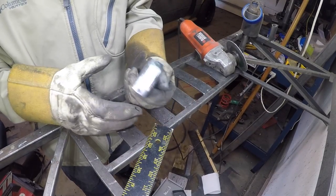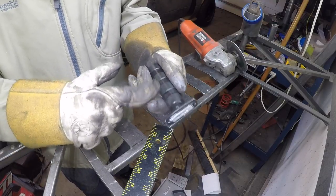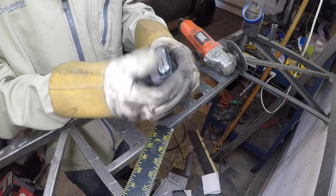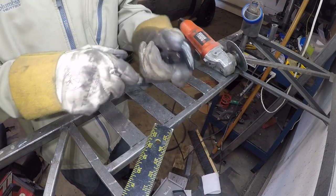Because this is aluminum, it does conduct a lot of heat, so definitely wear gloves. It's like nuclear hot all the way up to here. Now that we've got that knocked off, we can take a sandpaper wheel and grind this smooth. Once it's ground smooth, we can drill the hole out a little bigger and then paint it.